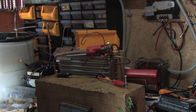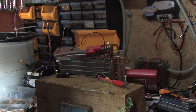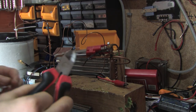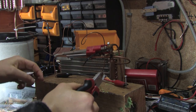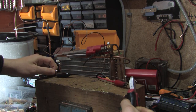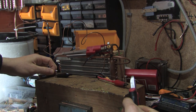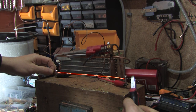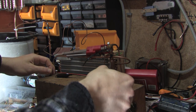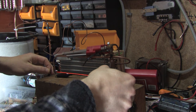I'll just grab a pair of pliers to hold one end. You don't want to heat it up right to the end though, because it puts an oxide layer on it which would make getting a connection difficult. So we simply just touch it like this and it'll heat up — don't let it get too hot or it'll snap — then it straightens out.